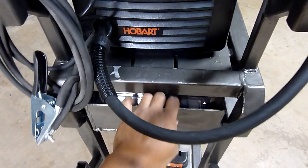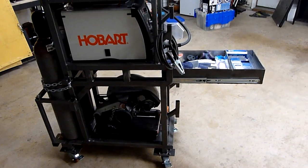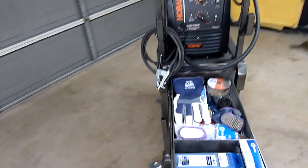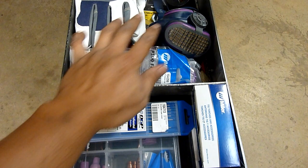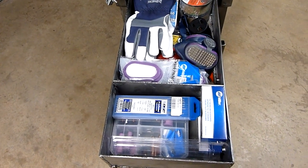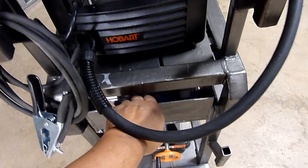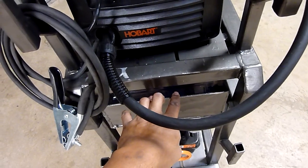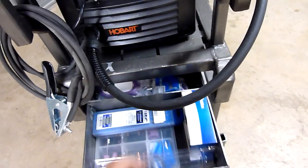One other thing I added was this little pullout drawer — let me go ahead and take a shot of that. It kind of adds a little bit more storage. It was something I saw online that a few guys have actually done, and I thought why not. In here you can see I've got TIG cups, tungsten, my mask, some gloves, filler wire, and all the other miscellaneous stuff I didn't want to keep all over the garage. I made the drawer a little bit longer just so I would have a lip to drag on. If I had to do it over again I'm not sure I would have done it that way — I think I'm probably going to weld on a piece at 45 degrees here so it closes the gap, because sparks could technically go in there. Maybe I'll add another plate on top to cover this, but right now it gives me a little handle to pull in and out as needed.